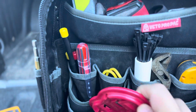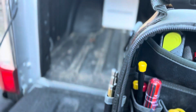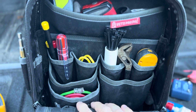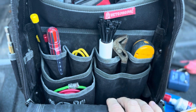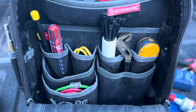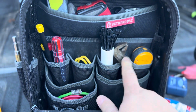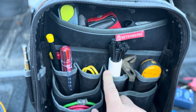When we trim out a TV and stuff, we just use a brush plate. I don't like to put an insert on there because it's just one more connection point. So if I'm running a bail-in back to a matrix, I like to keep one continuous piece of cat without any kind of inserts or things in the way. So we don't really do a whole lot of inserts, and I'm not doing many phone jacks and data jacks lately, so punch down is kind of going away. But there is a punch down tool here, my little pliers.